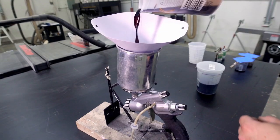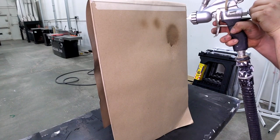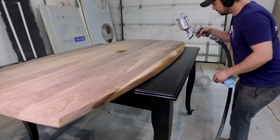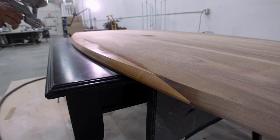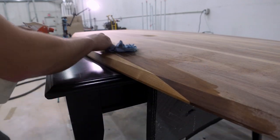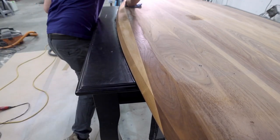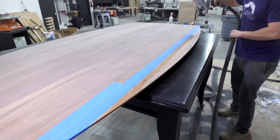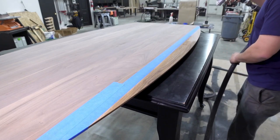The first color is the walnut color corrector — we want the spray pattern to be tight and precise. Spraying the sapwood boards with a little bit of color will help them blend into the browns but not destroy the beautiful contrasts they create. I'm not worrying much about overspray on the darker boards since this dye mixture doesn't have a binder and can be manipulated fairly easily with water. On the top, I tape each board off so I only color it and nothing else. Spraying very light coats reduces how much the colorant wicks under the tape — dark toners are much harder to blend.